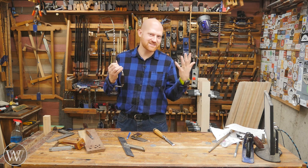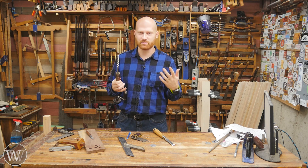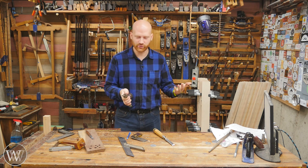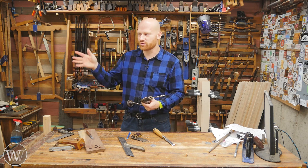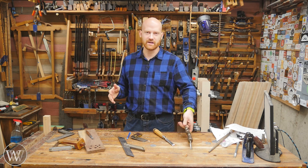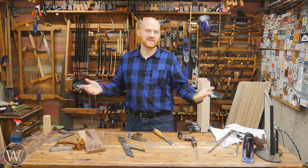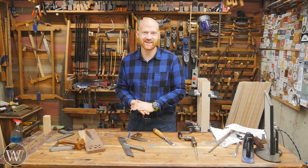This is a really simple trick, but once you understand it and put it to use a few times it becomes incredibly easy — you can do things perfectly by eye without needing a drill press. As long as you make sure the hole you want to drill is level, you can drill level without thinking about it. If you want an angle, put the board to the angle and you still drill level. It makes it really easy and a lot of fun.